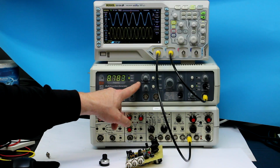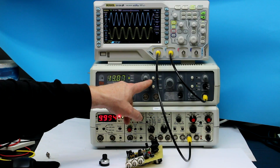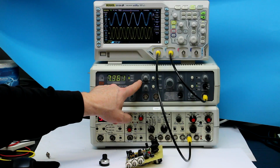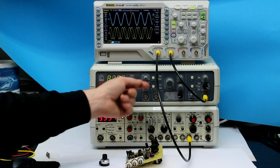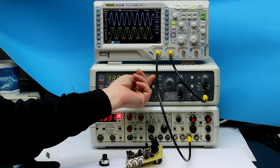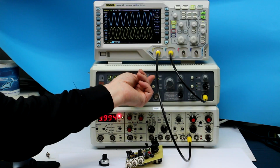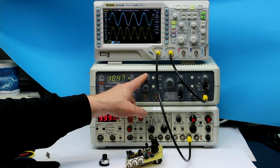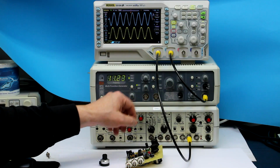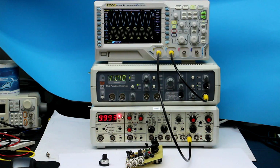And again, for the sweep frequency, it goes from 1 hertz to 100 hertz. That is quite okay. I would have preferred going from 0.1 hertz to have a very slow sweep up to 10 hertz. But again, a linear potentiometer. So at the first quarter of a turn, you go from 1 hertz directly up to 25 hertz. So much too fast. Using a logarithmic potentiometer, which would have cost perhaps €1 more, would have made this thing much more usable. So let's turn this stupid function off.